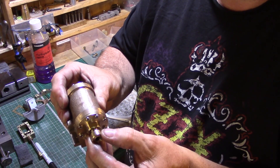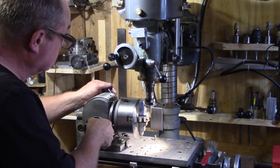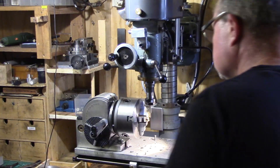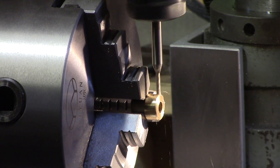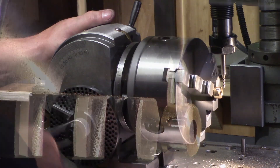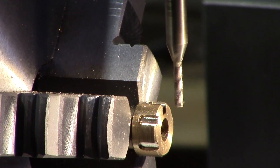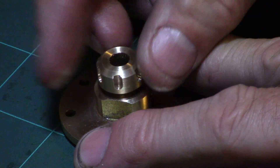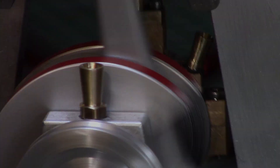The first job was to add some fluting around the cylinder gland nut, mainly to provide slots in which I can fit a spanner to nip up the nut should it require it whilst running. The nut was fixed in the jaws of my rotary indexer and I used the 24-hole dividing plate and indexed six divisions for the slots. This not only provides a useful finger grip but adds a stylized look to the nut, and the slots are ideally suited to fit a small micrometer C-spanner for adjustment whilst running.